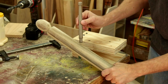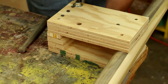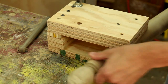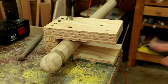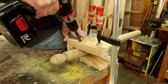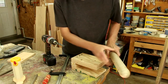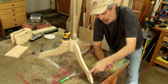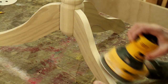I want these pegs to go in at a slight angle, so I've made up a little jig to help me drill the holes. I'm just going to clamp this to my workbench. I've made a dot everywhere I want to drill a hole, so I'm just going to line those up with this hole which I've pre-drilled at an angle, then clamp this side down to hold it in place. That worked out okay, so now these will just fit right down in there. I completely forgot I wanted to round over these edges of the legs with the router before I assembled it, so I guess I'm just going to sand them over now.